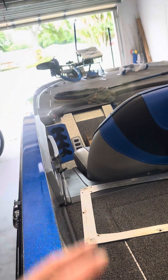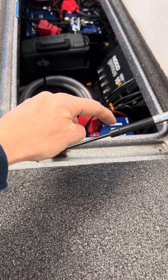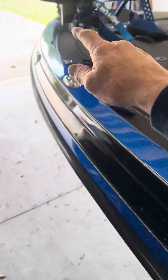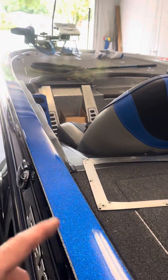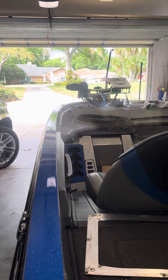Then I had an epiphany — I don't know why I didn't think of it sooner. Because I have a dedicated eight gauge wire that runs up to the Minn Kota Ultrex, I put a flexible fish tape on the negative eight gauge wire, pulled that negative line all the way up to the bow. While doing that, it was feeding a fish tape back toward the rear. I tied the new eight gauge to the fish tape and pulled it back through, then used the remaining fish tape to pull the negative line back through. To do both of those steps took about 15 minutes — but I had spent about four hours of trial and error I'll never get back.